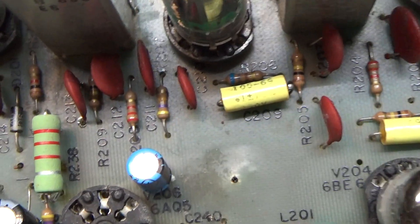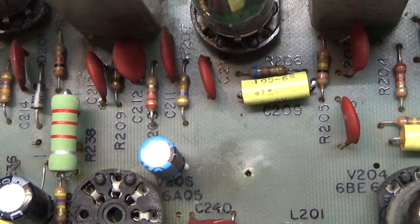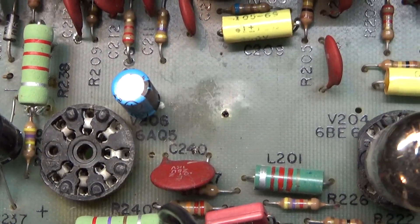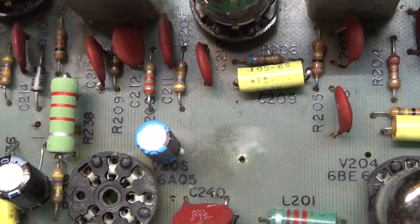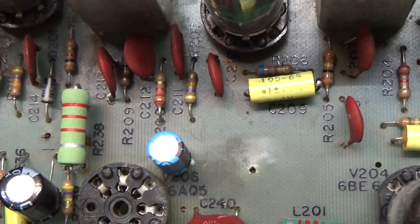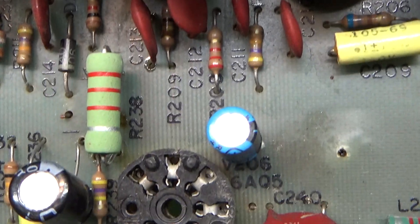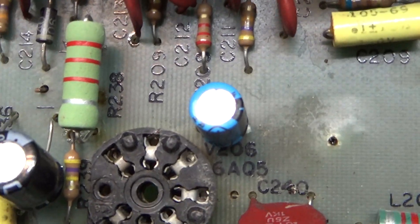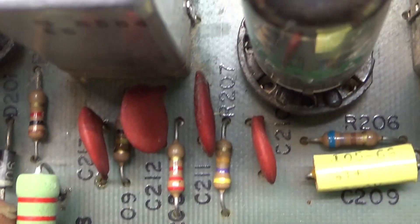The pin cap in a Mark 4a from the factory is marked as a 2UF or 2 microfarad red cap at 450 volts. A 2UF cap will not ping. You need at least 10UF for a short ping, or 20UF for a decent ping. From there: 40UF for medium, 60UF for long, and 100UF for very long. As you go with bigger UFs you'll need a bigger cap, and often they won't fit on the board so you need to wire it in somewhere else.